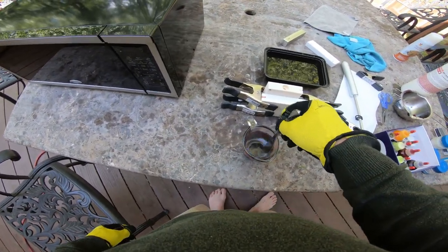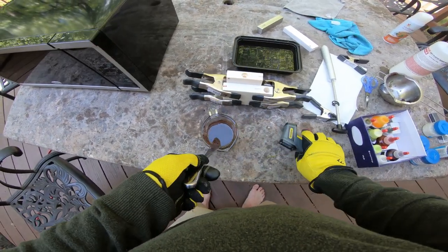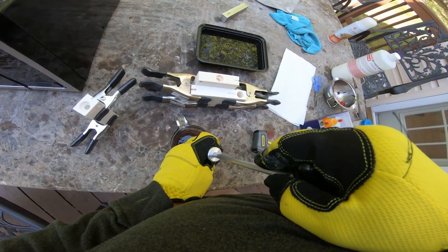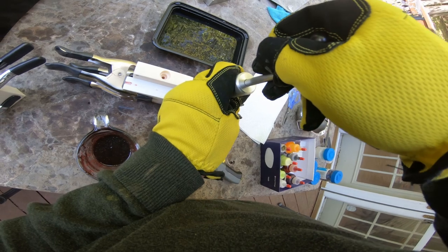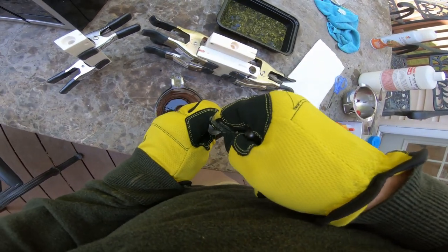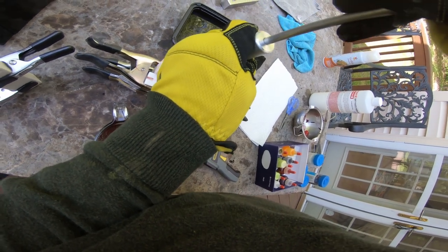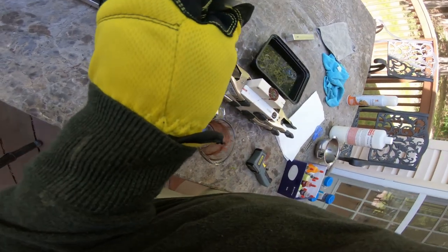We hit 418 — that's a little over temp. You don't ever want to take it to five or six hundred degrees and really cook it. We're coming down to 383, so you just wait for it to cool a little, stir it, then let her rip. Fill those molds up — fill it up, push a little extra on top, go in for a refill on the creature bait, nice and good. A little extra on top and hit this one while we're here.